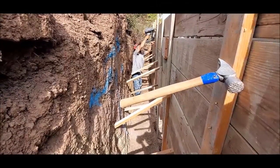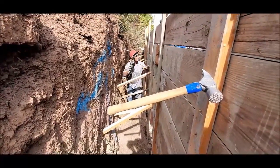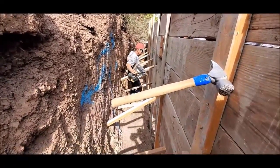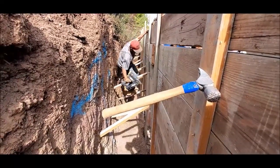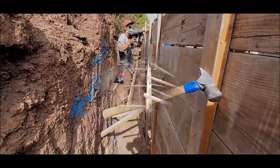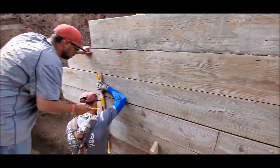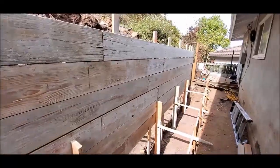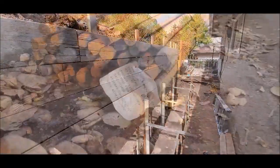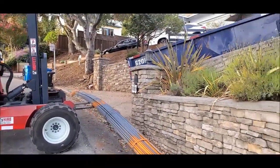It is a challenge working behind the wall — we have to make sure each kicker is secure, and this too can be time-consuming. Once we got the back established, it's time for some rebar. Normally we use number five rebar on our projects, but on this project we use number six rebar, 12 inches on center for the wall and footing.